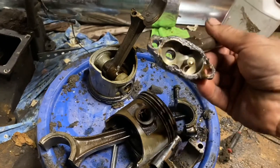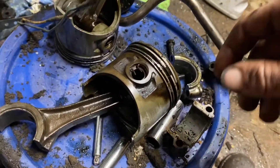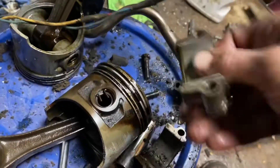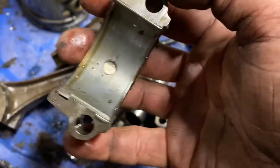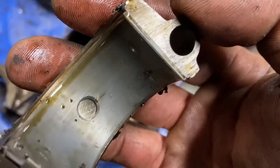I will have to get an oil pump gasket — won't be able to save that one, it's junk. The oil pump was kind of a pain to get to because it was deep inside here and one bolt was on the back side of this gear pump. Here's the connecting rod caps — they're not really in too horrible shape.